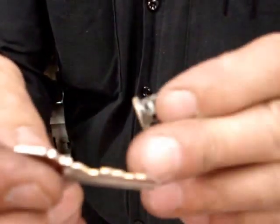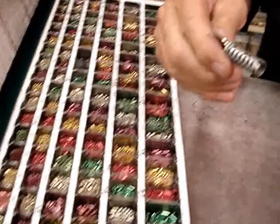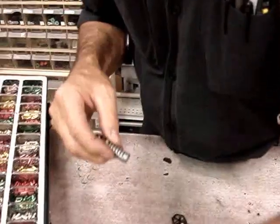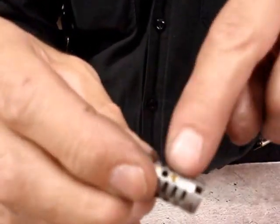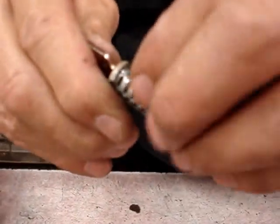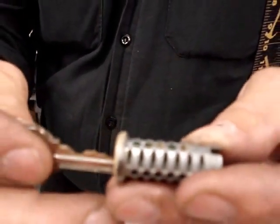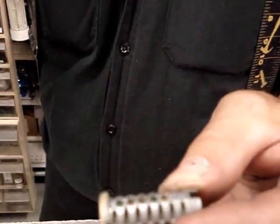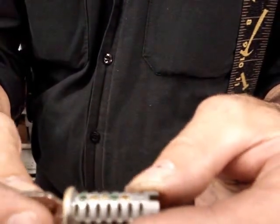What do pins four and five look like? Four is low, five is a little higher. We take a stab with a Kwikset four pin — way too low. So we go for a Kwikset five, and it fits the five hole pretty nicely. One more to go — a Kwikset six pin, and voilà, our cylinder has now been re-pinned. As we operate it, the pins go up and down, the spring-loaded pins are above, so when we take this key out, five spring-loaded pins fill all five holes. That cylinder will not rotate unless the pins are flush.